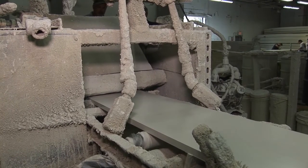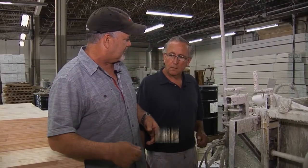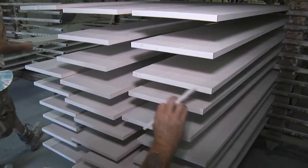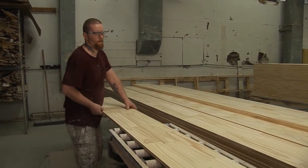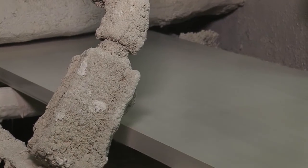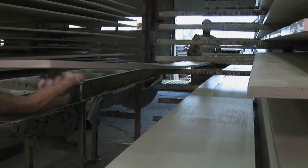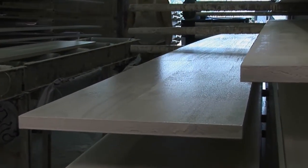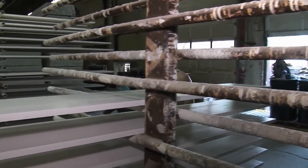This is just the first coat — there's other coats going on. It's going to bake overnight, it's going to dry. The ends are already caked. You already got one coat going before it even gets into the coater; the ends are sealed already to help with the potential moisture absorption. What's happening now is the raw substrate is entering the pressure rollers so that the wood conditioner is forced into the substrate. What you'll see when the boards come out is a white coloration — that's raw TiO2, which not only helps with the opacity, it helps with the first coat adhesion. This is not even the first coat of top coat — that's two additional steps after this. This is just the TiO2.